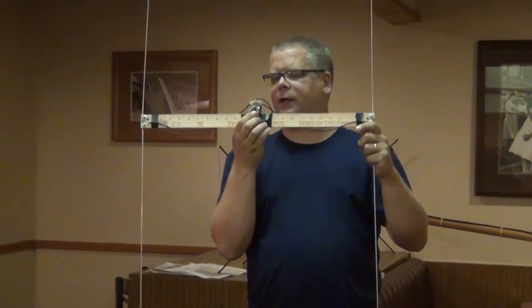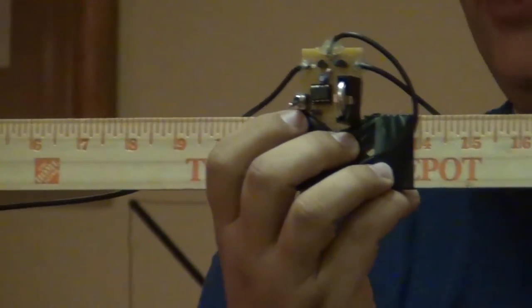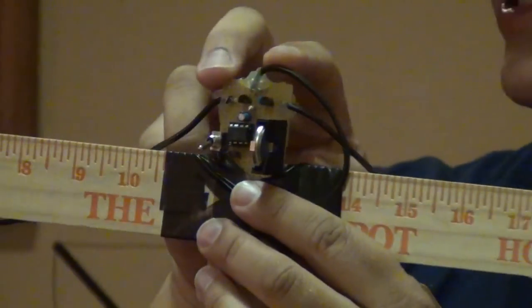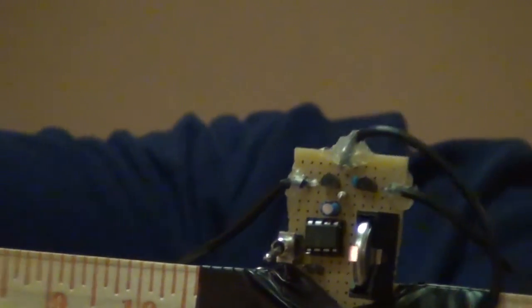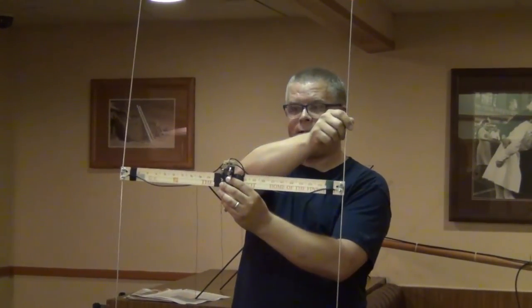Right now, it's a PIC chip, but it's basically working just like a 555 timer. It's just switching one of the output lines high and low at an audio frequency, like 500 hertz. And using some PIN RF diodes here and here, as that 500 hertz switches, when it goes high, that basically enables this antenna. And when it goes low, it disables this antenna and enables this antenna.